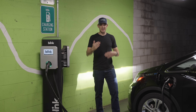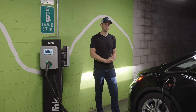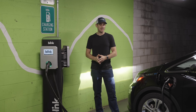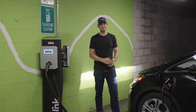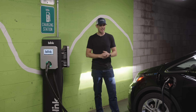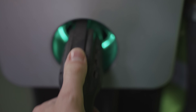Let's talk about the maintenance and durability concerns. I've seen this a lot on public Level 2 chargers — they'll have a broken handle, a broken cable. Cables break a lot, and having them on the floor doesn't help. When they do need to be fixed, a technician has to basically tear the thing apart to unplug the cable and put a new one on. It takes a lot of time, costs a lot of money, and these things might be down for days.